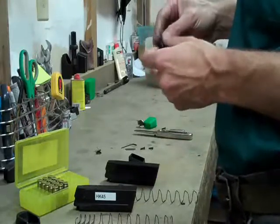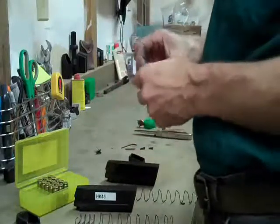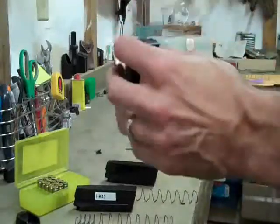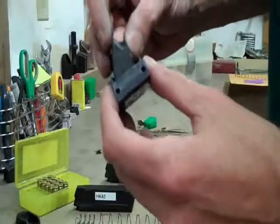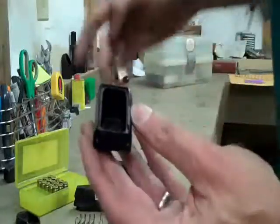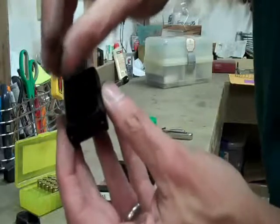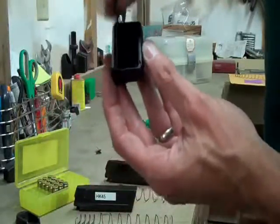When the follower comes from the factory, it's very square cornered. And what sometimes happens — I'm going to move in close to the camera so hopefully you can see it — is that on the way down into the base pad, the follower catches in this corner right here. That's because this is a round surface and with a milling machine it's very difficult to make a square corner inside of this surface. So right there is where our problem happens.